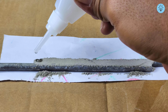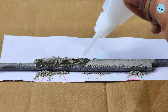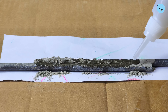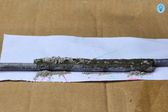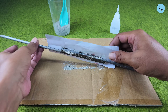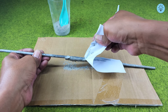The next step is to pour super glue directly over the powder. The cement and baking soda mixture has a very fine texture, which allows it to absorb the glue in just a matter of seconds. Almost instantly, the mixture will harden and form a solid connection between the two metal rods. Be sure to spread the glue evenly across the powder surface. I recommend placing a sheet of paper or thin cardboard underneath the metal rods to protect your work surface and prevent the super glue from spilling or sticking to your table.